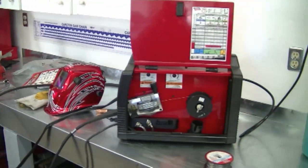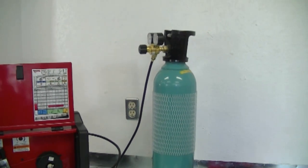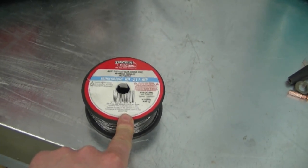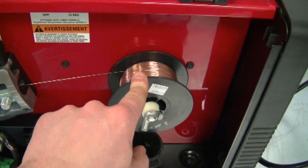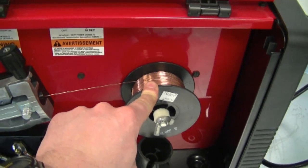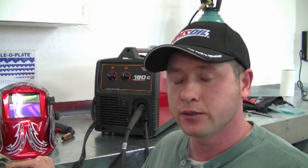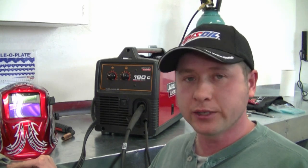If you get one, you're not going to be disappointed. I recommend getting the gas tank with it if you plan on welding thin stuff. When it comes to flux core wire, it will perform better for thicker metal and also if the metal is dirty or rusty. If you're using solid wire with gas, make sure everything you weld has been cleaned thoroughly — it's really important that your metal is clean before you weld. Thanks go out to Brendan from Get Bent Metal for his tips and tricks. You can check out his channel; I'll put the link underneath this video. You don't have to be a professional welder to get by in your small engine shop, but I do recommend paying a professional for some lessons or taking a course. There are some good YouTube channels that show great tips and tricks for welding. Thanks for watching guys, and we'll see you in the next video.